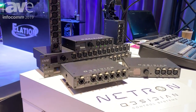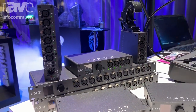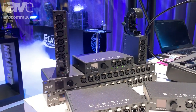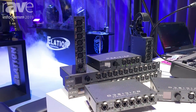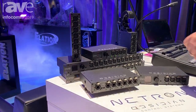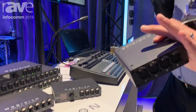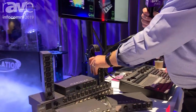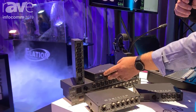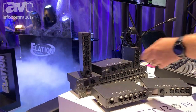In addition to that we have Ethernet nodes — the EP4, EN4, and EN12 — different sizes of nodes. All are EtherDMX gateways supporting ArtNet, RDM, and streaming ACN. They're configurable over web pages on a simple device like this with PoE power, or from a display on the front for the larger devices. They scale from 4 ports up to 12 ports.